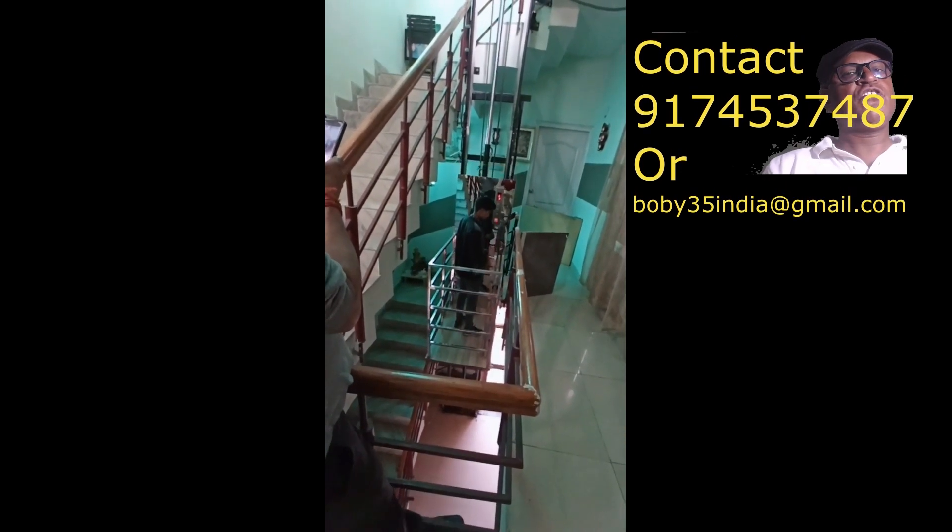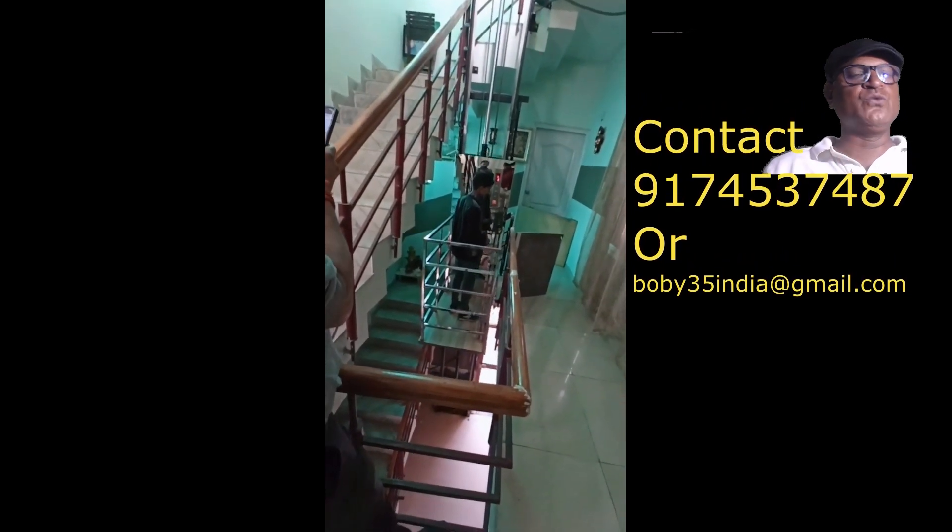As I mentioned, it's a very basic hydraulic lift, but it is quite safe and secure. It uses a two HP motor. In case of power failure or power cut, there is an option for you to come down. We don't need to dig any ditch for this lift as we do in a conventional lift, and we don't have to make any kind of machine room for it.